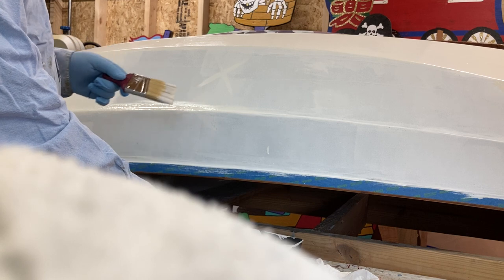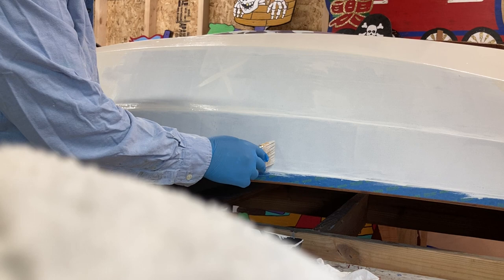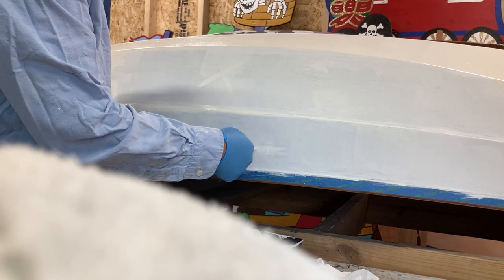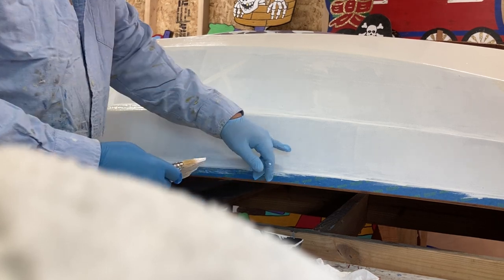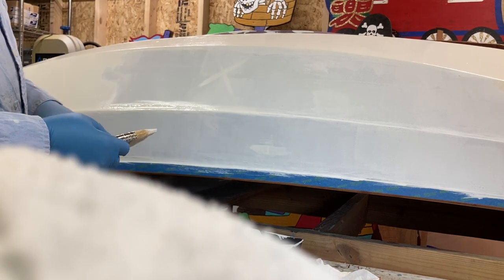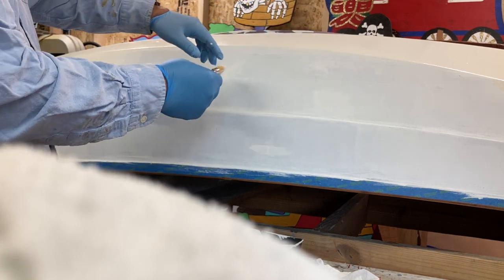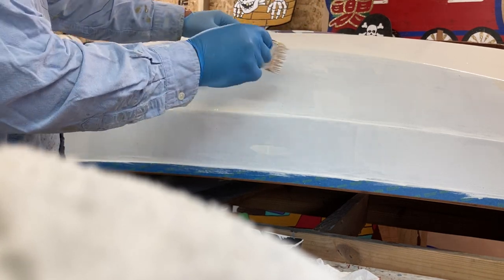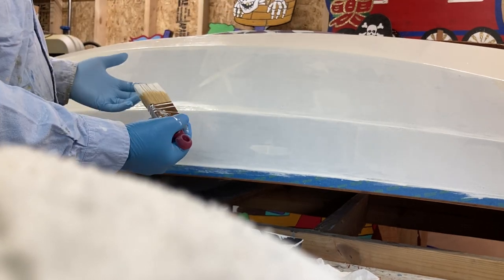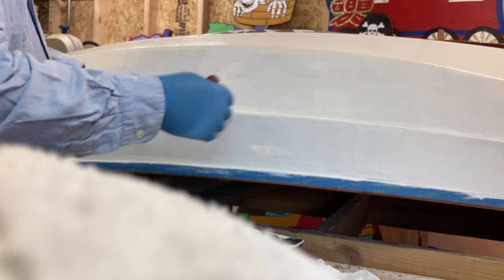So we've already dredged the seam, I call it, and now noticed some of the problems you may see come up. I saw a little drip here. Go ahead and knock that drip down now, because by the time I get around to that, it may be a blob that I've got to scrape off or do something else with, and I don't want to do that. One method we've tried for planking is to start at one end and do it down each plank and feather in. So lately what we've been doing is we'll just do a plank at a time and then drag the table back and do another plank.